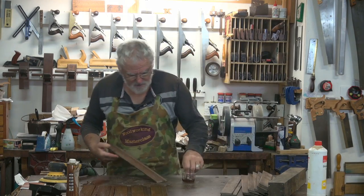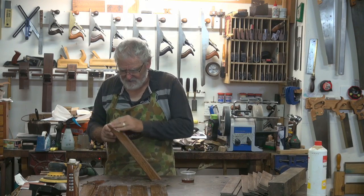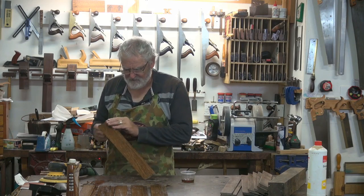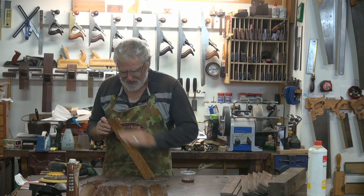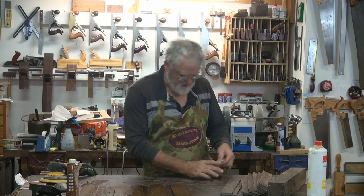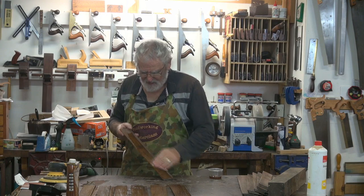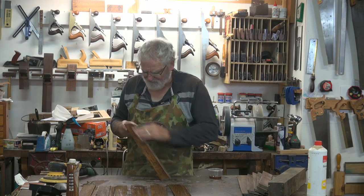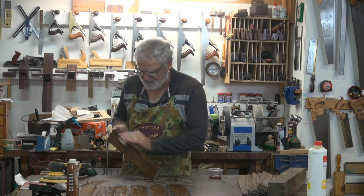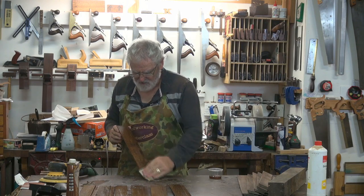Your Danish oil is good too. I don't mind Danish oil. In fact, we did a test. I've got the thing around here somewhere of all the different oils I've got. And there was about 6 or 7 of them. And really couldn't tell too much difference between one or the other. But yeah, Danish oil is nice, especially if you build it up and rub it in with 4-0 steel wool. I've done a few jobs and the finish has just been Danish oil. It's nice stuff.